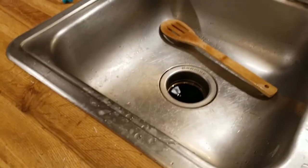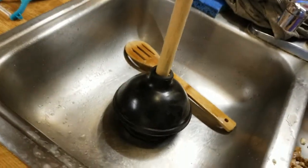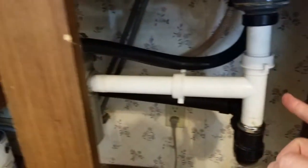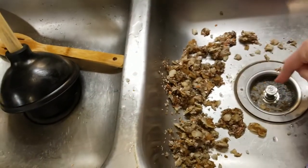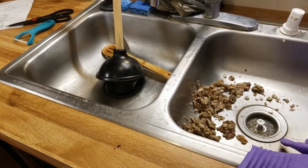The simplest form of mechanical cleaning is a plunger. You take it and plunge the sink. In a standard two-sink system, you've got the garbage disposal side and another sink — they come together and share a trap. To effectively plunge, you have to fill the sink with water, put the plug in, and hold it down while you plunge. In some cases that does work, but in the case of my sink, it doesn't.